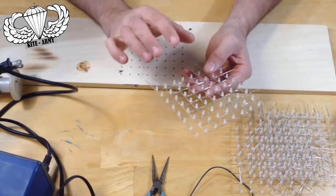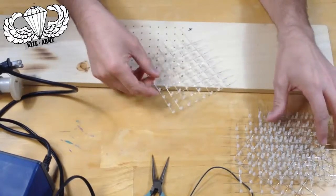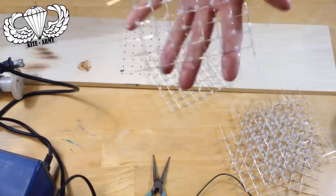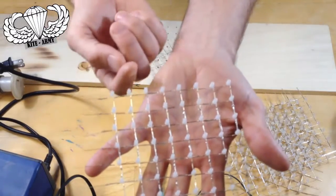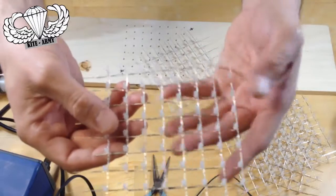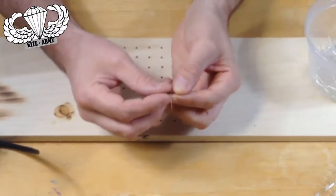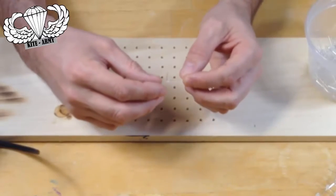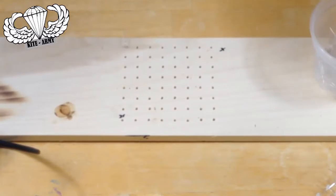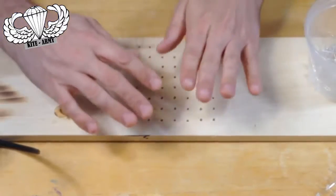I've been working on this 8x8x8 LED cube for a while now. You can see I've got a few grids already completed. Here's an up close of what they look like — you can see the LEDs face upwards. There are two connectors that come out of each LED, and those connectors make up the grid. What I've done is taken the longer terminal and bent it down while keeping the shorter terminal straight. That way when I place it in my grid and put the next one on, I just fold the legs over and solder them. I'm completing a grid in about an hour.